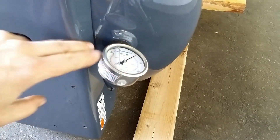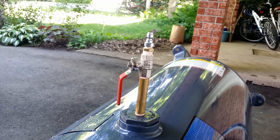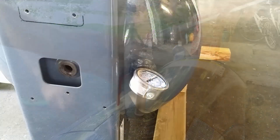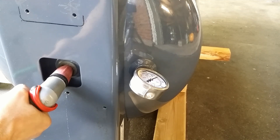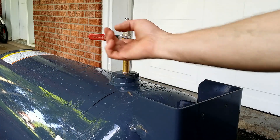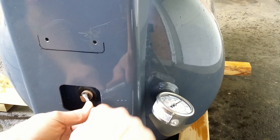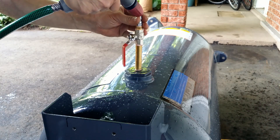Pressure gauge in. The outlet is turned into the inlet now and the pressure washer fitting is installed. Water from the garden hose — the nozzle is rubberized so it seals the hole nicely. I will pour the water in until all the air is pushed out and water flows out of there. Then I will close the nozzle, close this valve to prevent air from coming in, and quickly swap the nozzle for a plug. The air is out, the plug is in.